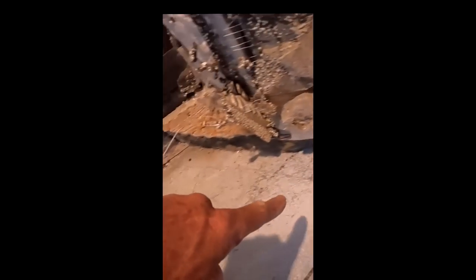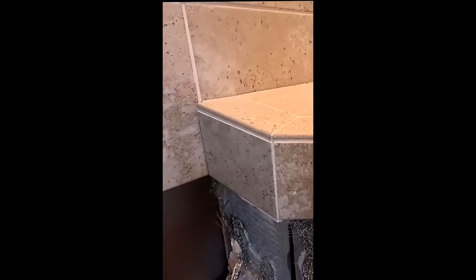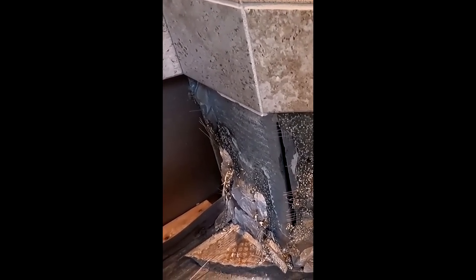So what I could do is go out maybe about 4 inches with my pan liner cut, and then overlap my next pan liner on top of that. And then I will have something that's monolithic going all the way up, and then keep the bench in place, prop it back up the way it was. See that? Prop it back up the way it was, and then leave it in place. Or just delete the bench altogether, which is preferable to me. But it's not my shower.